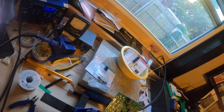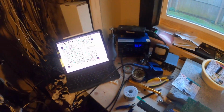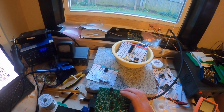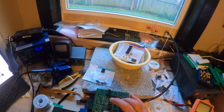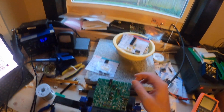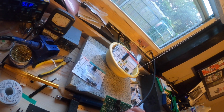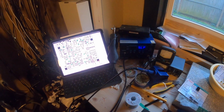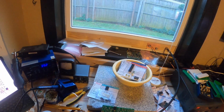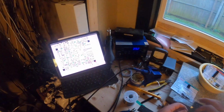So I went ahead and continued putting those capacitors on the board, identifying where they all go and putting them down there, and soldering one leg on, straightening the back leg that I had bent to hold it in place back out, soldering that side on. Like I said, there's 19 of them, and this is at 20x speed right here, so I was very cautious to get them all in the right spot.